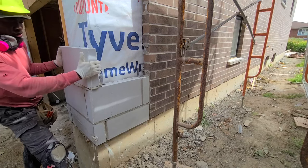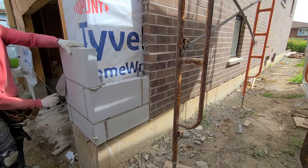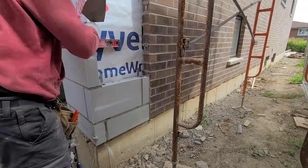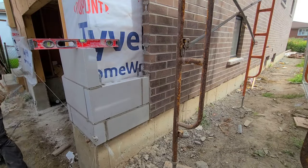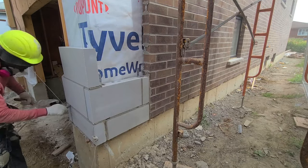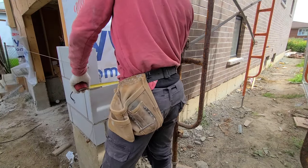You don't have to worry about if it's into the studs, because you want to make sure that you get it into a stud, so that way you know that it's solid. So here I level straight away, and I level across that just to maintain the plumbness of the wall. And if you keep doing that, you probably don't even need a line at the edge of the wall to maintain the straightness, because we're going with measurement and we also plumb and level them.